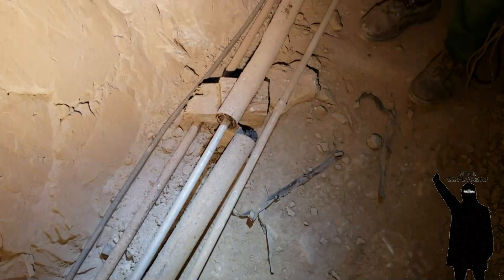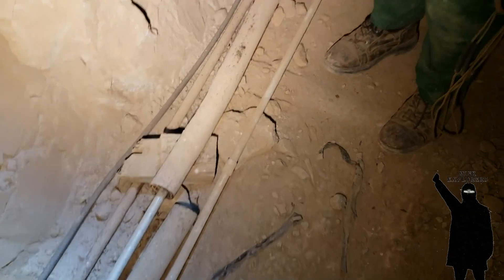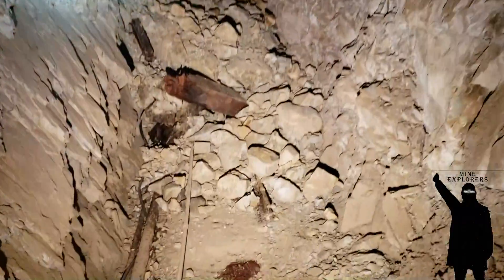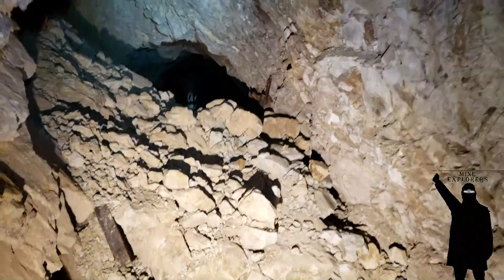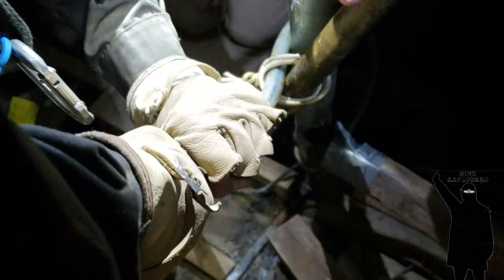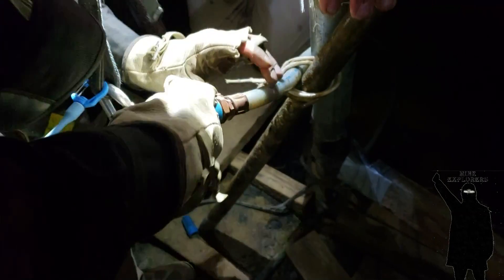It's just a half-inch galvanized going into this bigger two-inch pipe. Obviously this collapse was here and what they did is just cut the pipe off and pushed the new pipe through it. This is a check valve — when I blew in here I could hardly blow through it. I would just put it back down in there but it should be primed enough to work.